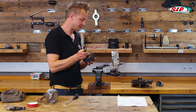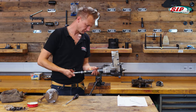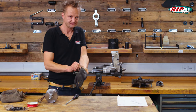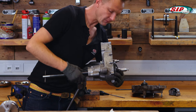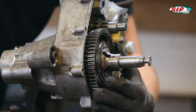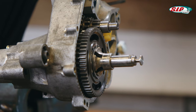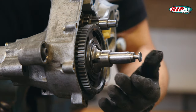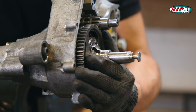Okay, let's mount the main shaft. Make sure when you pull in the main shaft that all gears are within the other gears, because sometimes they get on their tips together and then it cannot slip anymore. If you move it a little bit up and down then it becomes easier again.